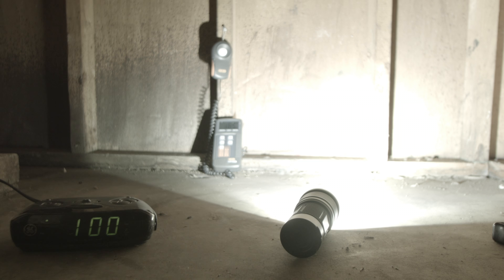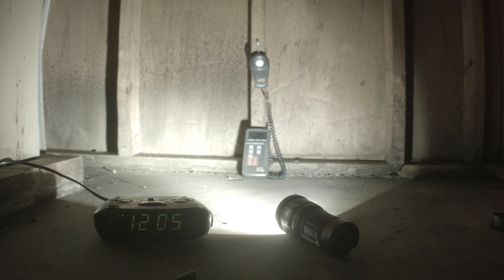On turbo and high with this flashlight, gloves might be a good idea if you're going to be using it for extended periods — otherwise you're playing hot potato. Thrunite says it has an internal temperature regulator: when the LED or driver temperature reaches 176°F or 80°C it will cut power. I decided to check out a different level — I waited till it got to the high end of the scale, counted one Mississippi after it was done blinking, and this is where I'm at. Just to demonstrate it ran at longer times than 1 hour and 20 minutes.